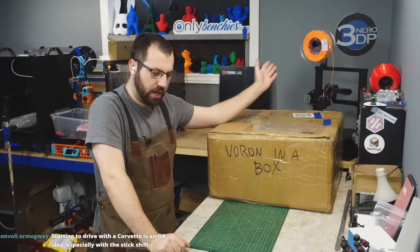Okay, so power supplies. It says Meanwell, RS25.5. This is a power supply for your Raspberry Pi. Now, why do we spec an RS25? Why do we spec an actual power supply for the Raspberry Pi instead of a buck converter? These are usually more stable and higher quality. You're less likely to have issues with a power supply than a buck converter.